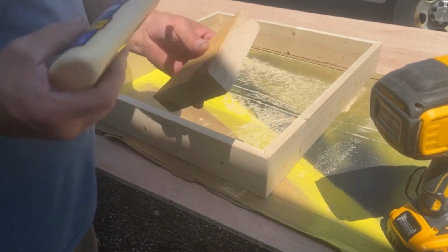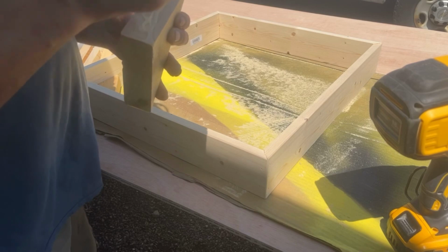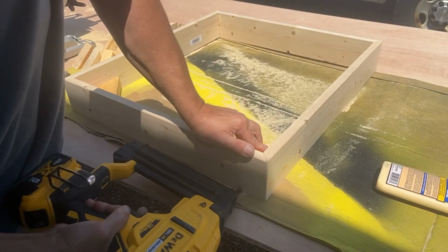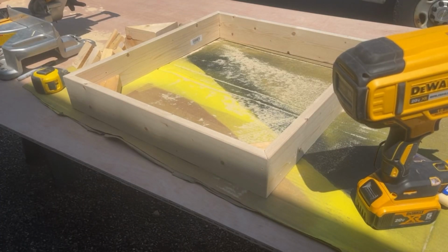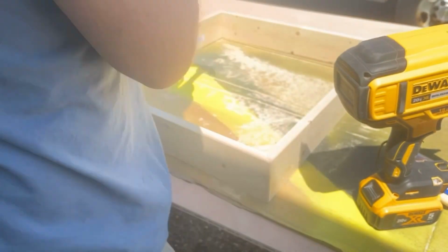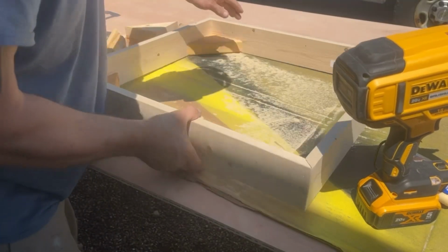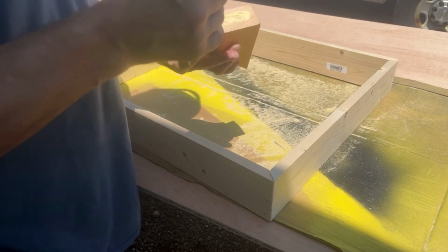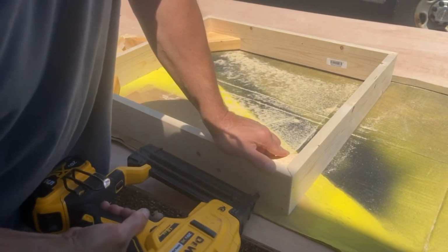And by putting these in the corner, cut at a perfect 45 degree angle, your base of your cabinet should be nice and square because all these 45s are tight in the corners. So as long as your corners are all lining up, you'll be good. This one actually slid a tiny bit. So I'm just gonna take my hammer and tap it in. Okay. This bottom of this cabinet will never be loose again. It'll rot away before it becomes loose.